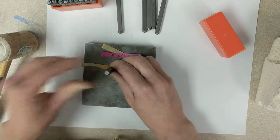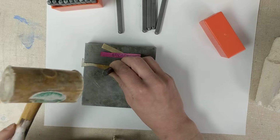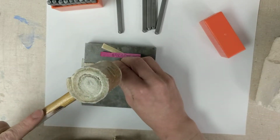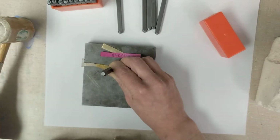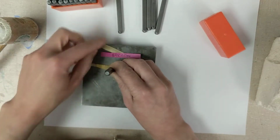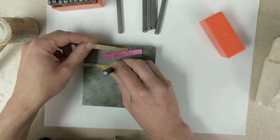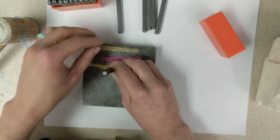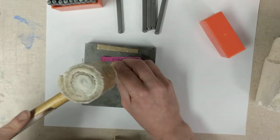and you have to hit it multiple times. I like to hit it probably about twice from the top, and then also kind of leaning slightly with my hammer on each of the four corners of it. That way I can make sure that I don't have like the top of the B more pressed than the bottom. This also works best when you've already annealed your metal and when you've done some sanding, so that you don't have to worry about going back and sanding and losing some of your piece, and it's softer metal because you've annealed it. All right, let's try it.